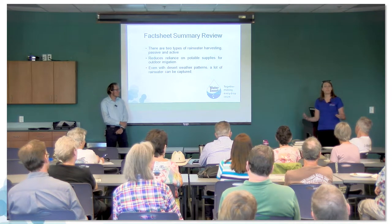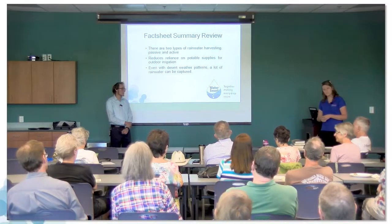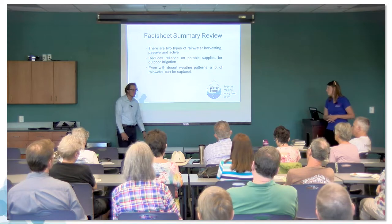That is important to know. When you're building a passive rainwater harvesting system, the place you don't want to divert the water is into your neighbor's yard. That's something to avoid. You want to make sure that the drainage works well so that if it does overflow, the water has a place to go so that you're not just draining into your neighbor's lawn, because that starts civil arguments, right? And that's why we are going to have a passive rainwater harvesting guide posted onto our website, which will give you the step-by-step. And Nick actually told me this when I was walking around Prescott College with him: you watch the water when it rains, and then you watch it again, and then you watch it again before you put in a system like this. You want to make sure that you have a good idea of what your natural landscape is already doing before you install something like this. Yes, it takes time and observation. And in Brad Lancaster's books, that's the first and last bullet point that he has. Observe, observe, observe.